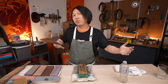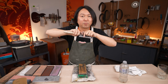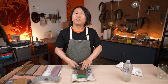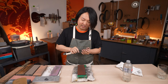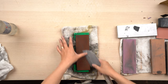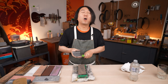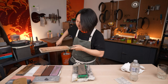From here I'm going to do the last step: sharpening the micro bevel. I'll use the Hibiki 1000 — it's really nice and hard, straight, and flat, and gets a really nice crisp edge. Hold the knife at 15 degrees. If you want to learn more about basic sharpening, check out the other video. Do this until you raise the burr. After you raise the burr, take the burr off. Finishing up with a little leather stropping action.